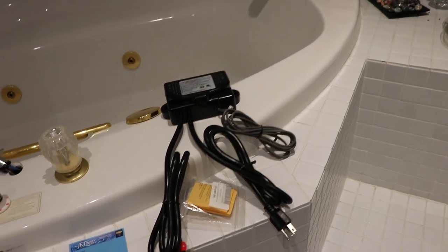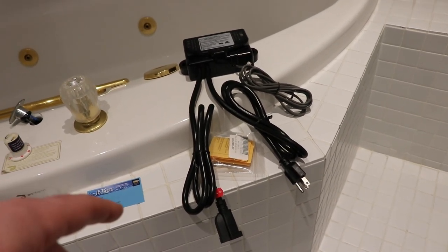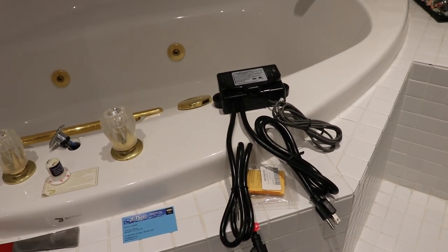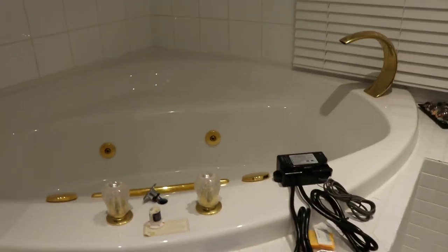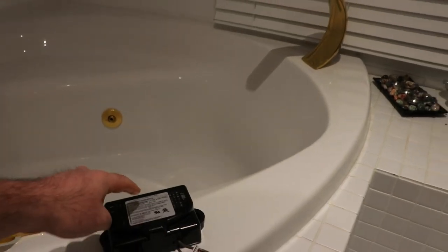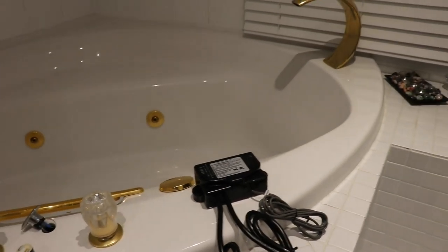You can do two things. You can put a junction box under the tub and wire things in by cutting the cords off on both ends. But I chose not to do that, so I put a receptacle under the tub that's GFI protected and also put a cord end on the electric motor so that I could plug it in like a conventional install. Obviously you need to turn off the power - you've got to have an electrical tester to turn it off and verify it. The GFI port is right here so I'm safe. It's far enough away from the tub - not going to get shocked or anything.